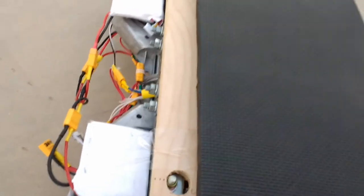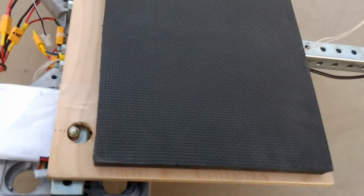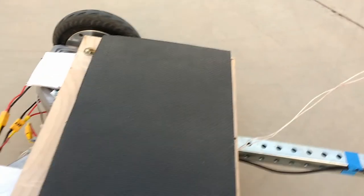They will activate the brake. Now, the brake on this system is nothing more than it shuts off the motor, so don't continually keep running with them. It does not have a mechanical brake, which is something that you need with the speed that these things go at maximum speed. And the fact that these are scooter wheels, very smooth spinning, very fluid, when you cut out of this wheel, it keeps going. So if you build up momentum with this, it'll just keep going for a little bit.